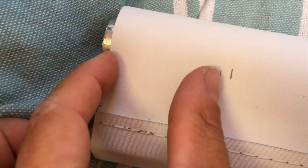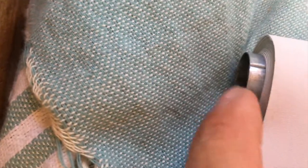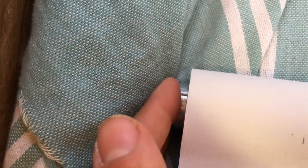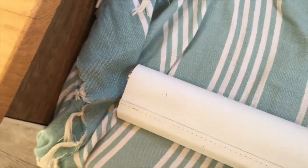All we need to do now is cut it down — it's 140 cm wide and we need to cut it to 136.5 cm. That first pencil line is where the metal needs to be cut to, and the second line needs half a centimetre of a lip so that as the screen folds up it doesn't touch the end of the bracket, maybe if it's going up at an angle. We're going to get that cut and then hopefully get it fitted.